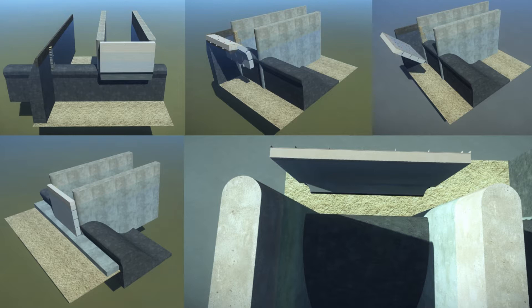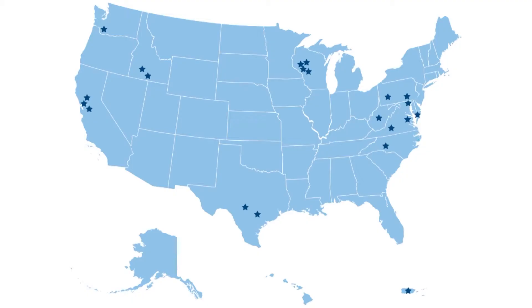We have designed bulkheads that rest on the spillway sill when installed. Some dams have a seat the bulkhead is designed to sit upon, and in other applications the bulkhead is floated into the pier noses and held into place by the upstream water load. Abutment seats can also be used for spillways with only one pier.